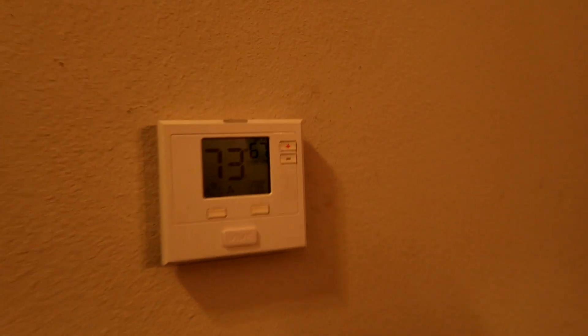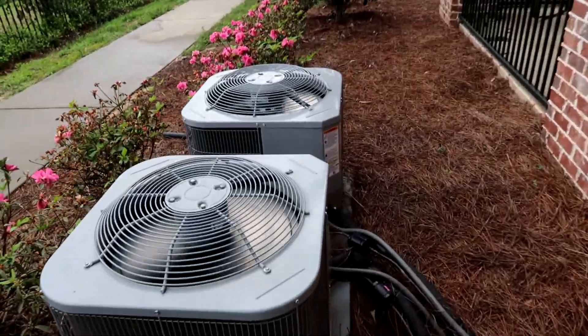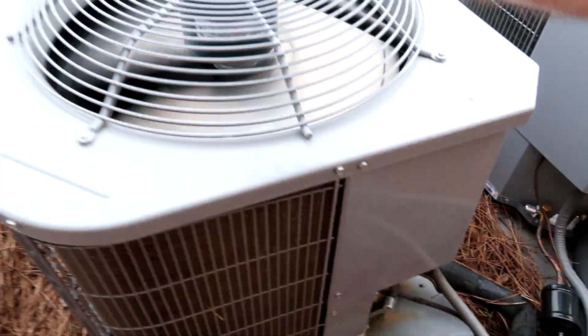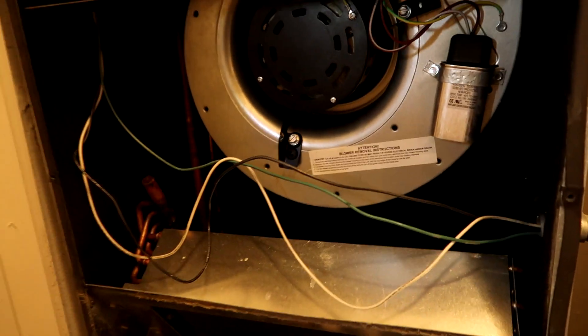There we go — see how the cool-on stopped blinking? I don't know why they put a heat pump thermostat on a straight-cool system — there's no delay needed, so I had to wait out the heat pump delay. The outside is on. We got away with one — glad I didn't burn that transformer up. Moving some good heat. Let's go button it up. Just an old bad contactor on the condenser outside — that was the culprit.